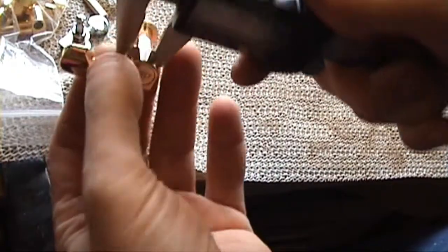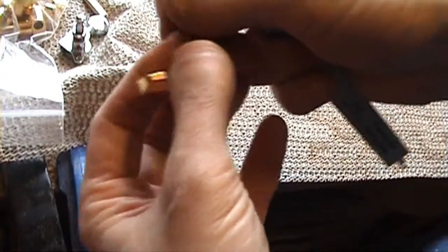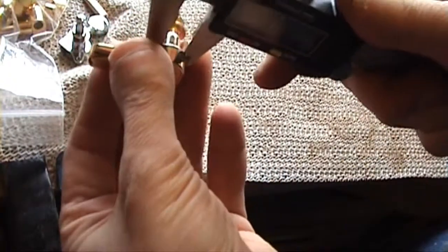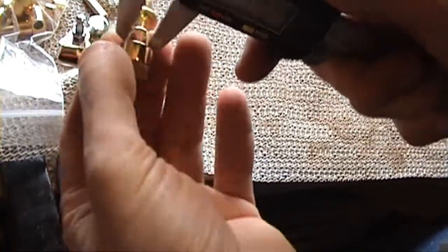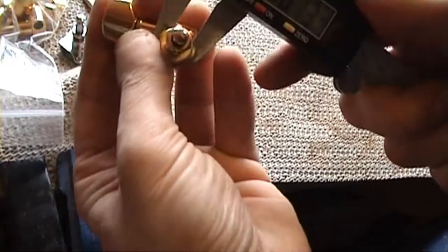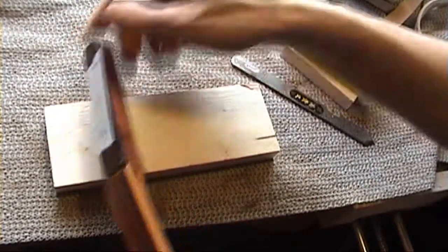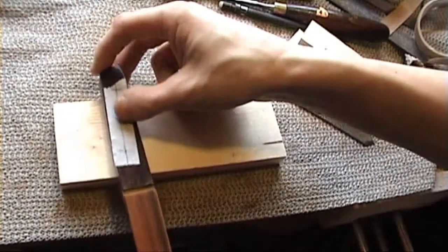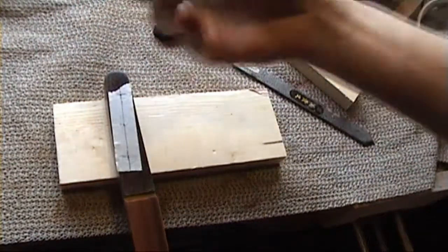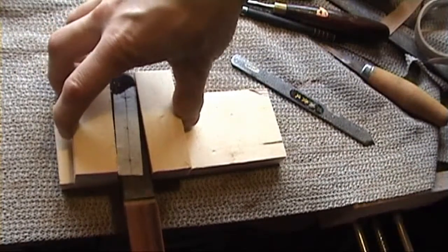This is like 9.76 millimetres, so for softer cedar or mahogany you would make the hole midway for a nice push fit. The wood I'm using is quite hard, so it's not likely to dent — I would go for almost 10 millimetres. To secure the headstock while drilling can be quite tricky, so I'm going to do this on the bench drill. I'm going to position it correctly and glue on these support pieces to make a wedge sort of fit.